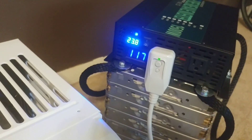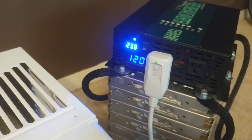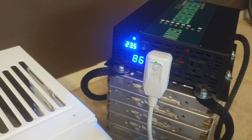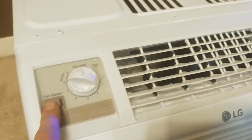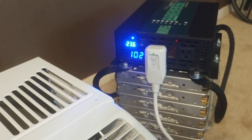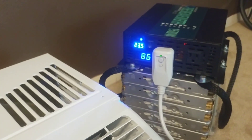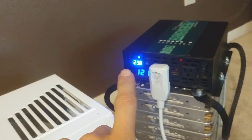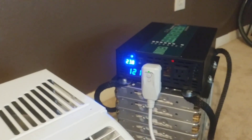Let's turn this on high — do it again on high. See this voltage dip? Alright, it didn't do it this time. I hit it on high and it would not turn on the compressor. Try it on low — nope. Let's see if I can tear it back apart and see if I can turn up the voltage a little bit to help kick this on. So far, no good.